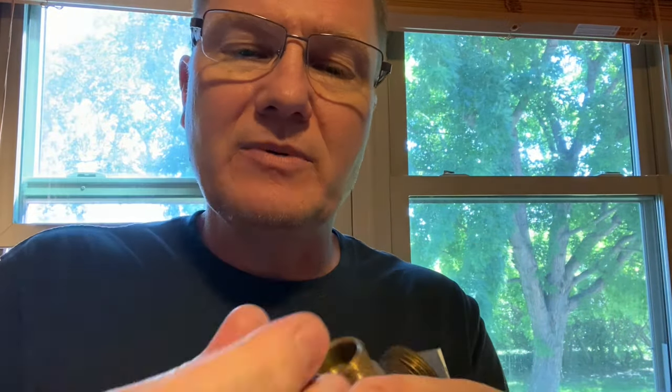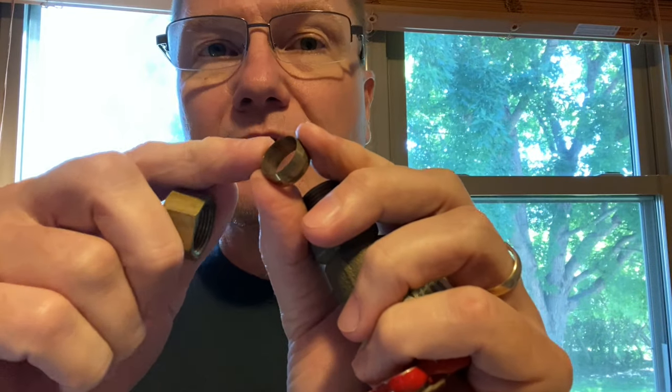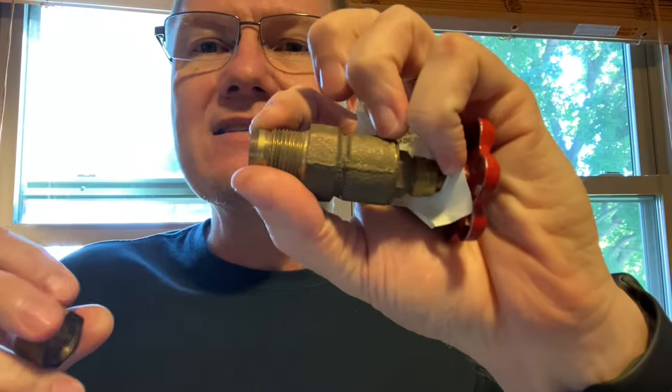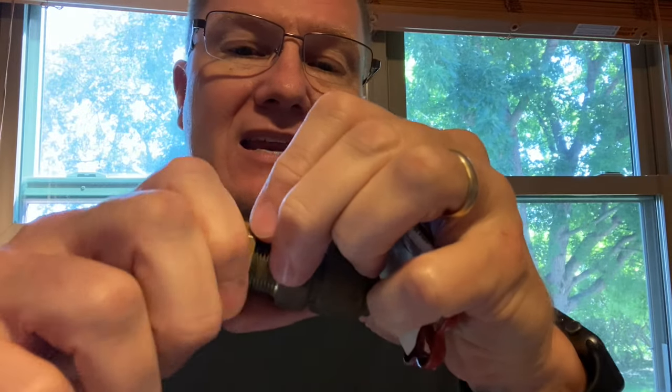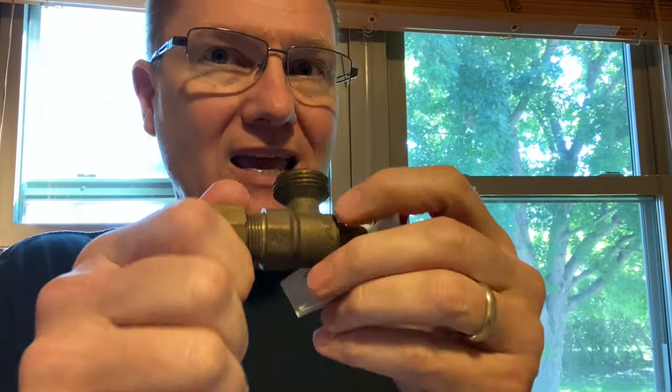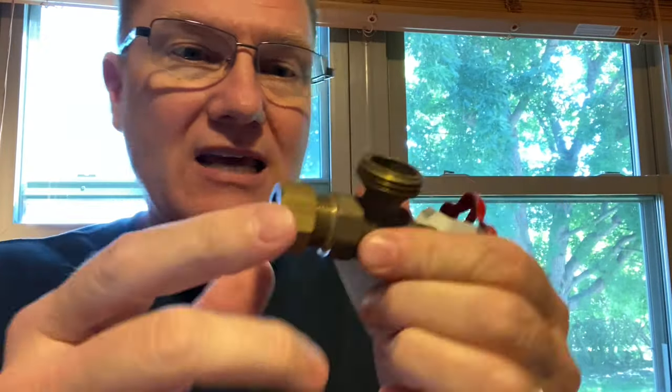Another spot is garden hoses and similar fittings. This particular device has a compression fitting — you put the nut on your half inch copper first, then you put the little copper ring on. When you put it together, the copper ring gets squeezed between the fitting and the nut, compresses slightly, and seals against the copper tube. That little ring is basically crimped in permanently — it's a one-time use — and no Teflon tape is needed on this type of connection.